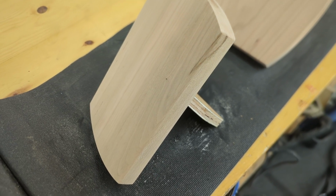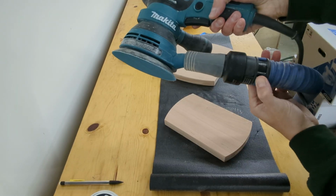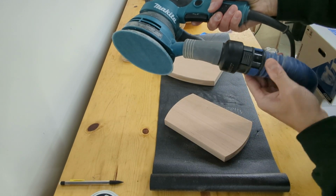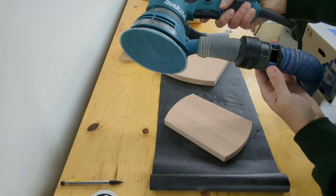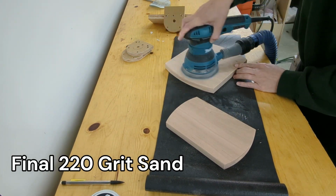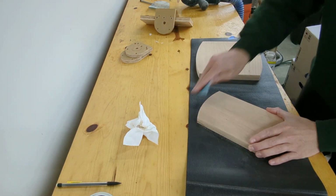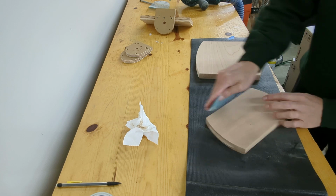Way too much water on my water pop, it's fine, everything is fine. Sandpaper works nicely, I like it. For the 220 sand, I open up my vac hose to bleed off some suction to avoid sanding marks. The dust cart setup I have has a lot of suction. This 220 sandpaper seems really nice, and I don't think I would have had sanding marks either way, but just to be safe.